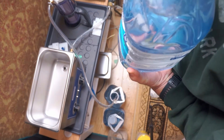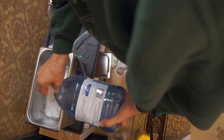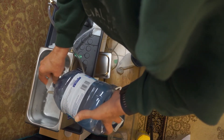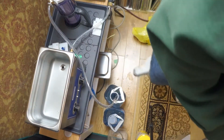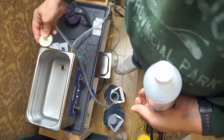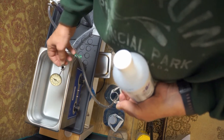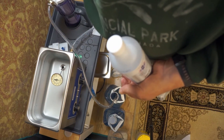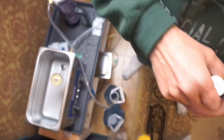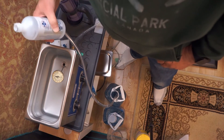Make sure my drain line is closed and I'll pour in four liters of distilled water. Now let's see if we can track the endothermic reaction that's going to happen — I'll put a little thermometer in there and wait for it to stabilize a bit. Looks like the temperature is at 56 degrees Fahrenheit, about 13 degrees centigrade. I'm going to add half a liter of 99% pure isopropyl alcohol.